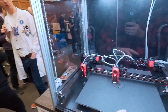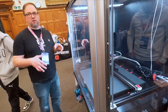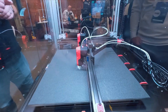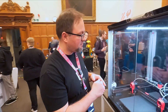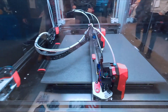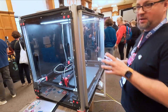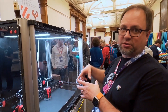For the tool head boards, they're the Stealthburners with Clockwork2 R2. Some updates include the doors being a little bit easier to open and get to the tool head boards, and they have a filament runout sensor. On these, we're actually using them as a load sensor because there's a separate runout sensor in the back. We detect runout in the back, and then when you unload and reload new filament, it will do the shimmy getting off the nozzle rests and extruding and priming itself.